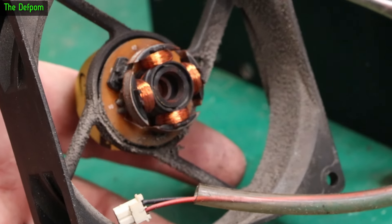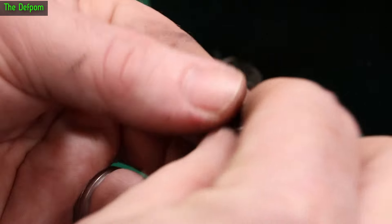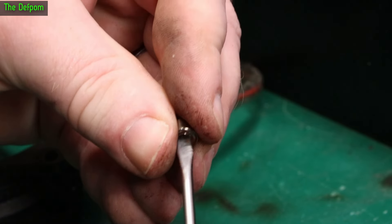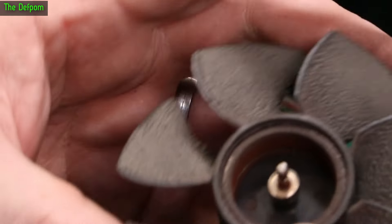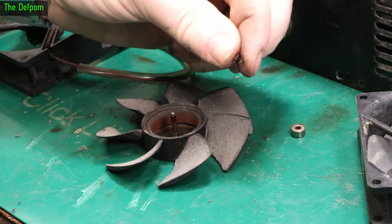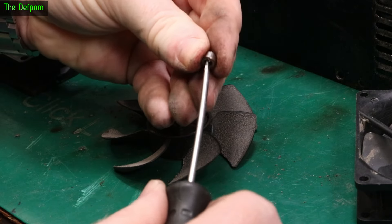That's what the inside looks like — typical brushless thing. But you can see the rust down inside that side as well. Maybe it's salvageable. There's the bearing — came out easy. It actually feels alright. I thought it was rumbling a bit when doing it by hand with the actual blades, but it feels okay. There's not a bearing here, maybe it's the other one. Oh yes — that bearing there, this one's the problem. Pretty sure it's not meant to do that. Yeah, that bearing's gone.